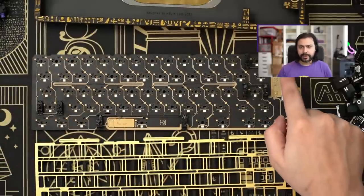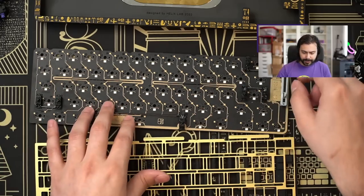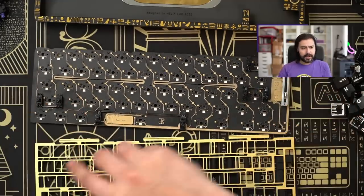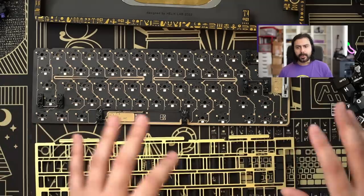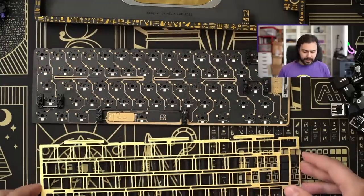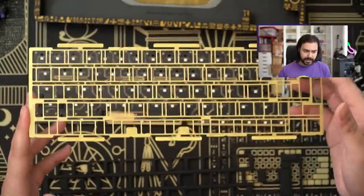So when you shove it in there, it really holds on. I said that the slider stem can also bend during assembly and disassembly. Basically, if you don't take the plate PCB assembly straight from the top and you bend it a little bit, the case will actually bend this, I don't know what this is called, slider stem, I guess. Also said a fully flat bottom piece may be the culprit for the loud and echoey sound of the keyboard. Have you experimented with grill cuts or just adding any sort of complexity on the bottom to try and resolve this? And then I said that the stock plate full of holes is relatively high pitched and sound reflective. So can we get something like this that isn't terrible?